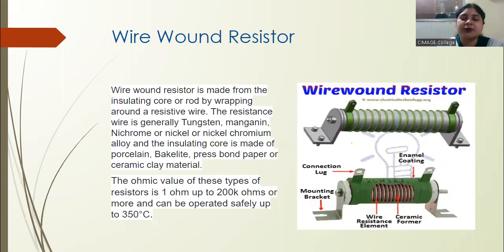In a simple manner: there is a rod that is made up of an insulating material, and a conductive wire is wrapped around the rod in such a way that it provides resistance of various ranges. A cap or handle moves along the rod to decide which resistance value is given.